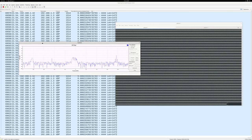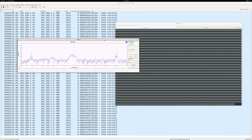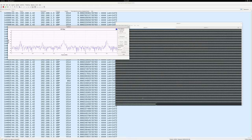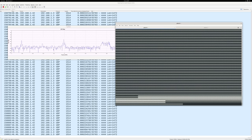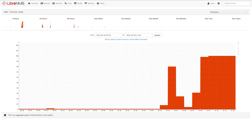I thought I'd do a crazy experiment. I put GNU Radio on a Raspberry Pi 1 up in the roof — just tuning a frequency and sending it out as UDP onto the network. Down here on the main computer I'm receiving the UDP and putting it on an FFT chart. You can see the data coming in, but there are a lot of overruns — it just can't keep up and it's very jerky. Looking at the processor usage, it's flat out at 100%.